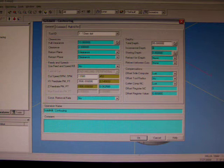Operation where we reduce our cut depth to a very small amount, so 2mm, but we're going to run pretty high feed rate, so we're going to bump our feed rate up to like 6,000 millimeters a minute, so that's 6 meters a minute. In engineering, the way your feed rates are calculated is if you imagine your cutter is spinning, the circumference of your cutter is used to work out what's called surface speed.